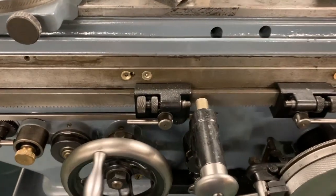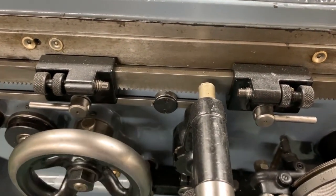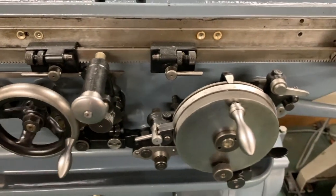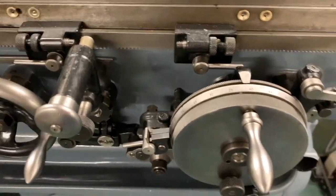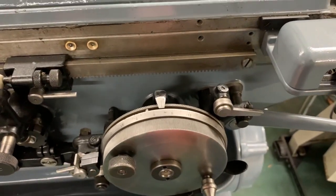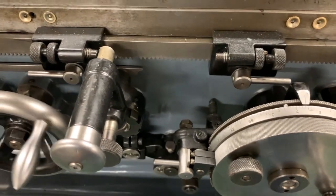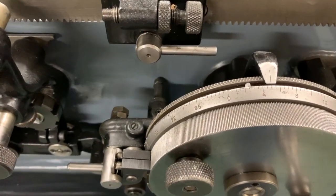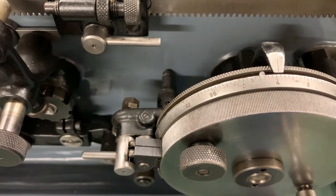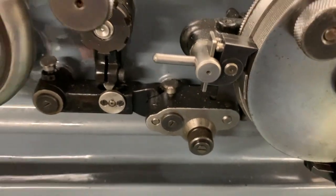There are adjustable stops that you can see operating here, and they are very easily movable just by pressing the levers down and sliding them along. The wheel in feed is controlled in two ways, either manually by simply moving the main wheel here, or automatically by engaging these small fingers that go in there. And then as it goes around, as the table moves, you can see that the in feed is slowly advancing. That's fully adjustable and can be set by tinkering around with all of the clever devices here.